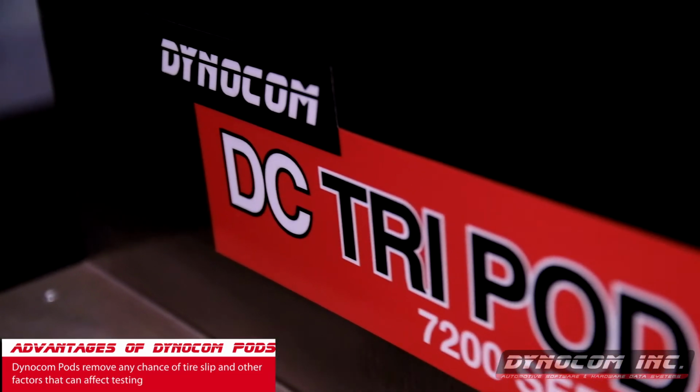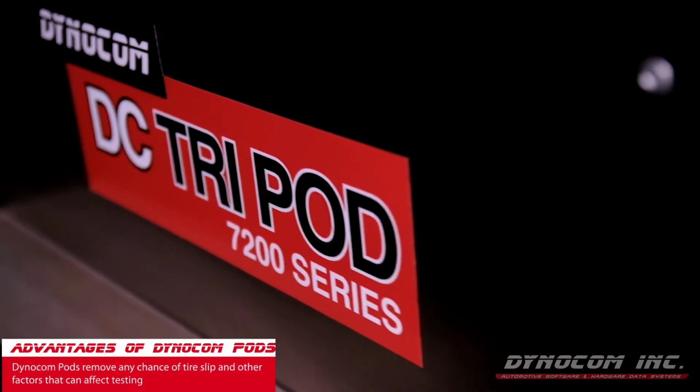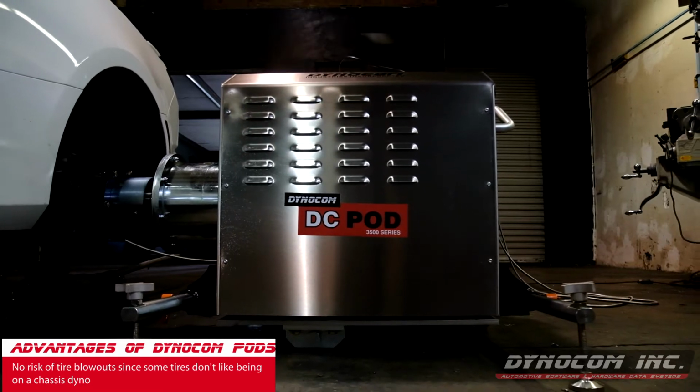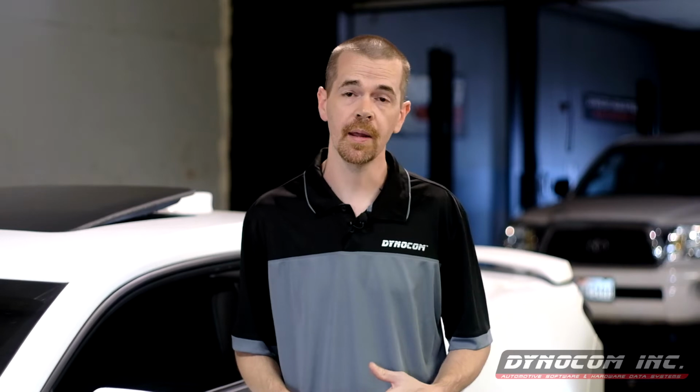You're going to eliminate any kind of tire slip to make sure you get all the torque in the measurement process. They also will eliminate any problems with having tire blowouts, since some tires don't like to be on a chassis dyno. We're going to be going over Mode 1 and Mode 2 operations and show you how those work.